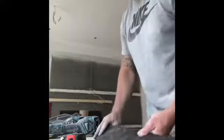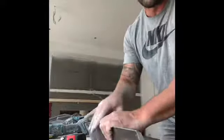Now you can see I have a much cleaner, much tighter miter. There's just a hair of a flat spot right there, about a 1/16 of an inch. So I'm gonna go on the top and just make sure this top feels nice and smooth. Last thing you want is to put a miter in and then someone puts their fingers on it and it's super sharp. All right, guys, so we did that miter. We went ahead and got it all installed, and let's go check it out.